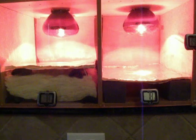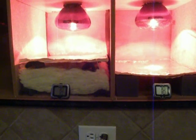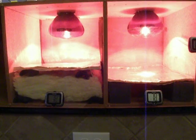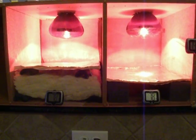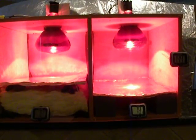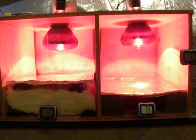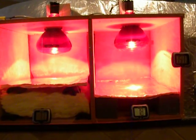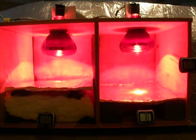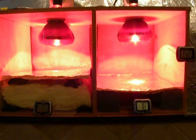The purpose of this test is to primarily show the effectiveness of the Solar Guard Radiant Barrier against UV heating. There are three types of heating, the first being radiant. That's what you're observing with the ultraviolet lights. Those lights are heating up the interior of that box. As they heat the air, the air then becomes a convective heat source.